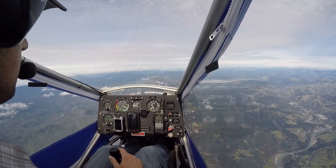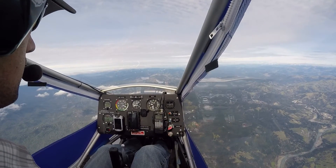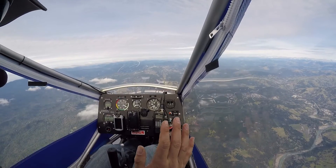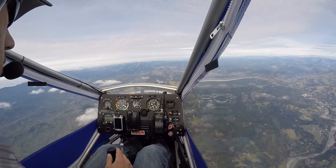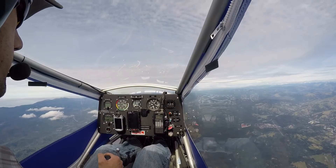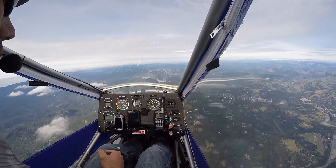All right, we just completed our clearing turn. We're at 7500 feet — 7000 feet above the lowest spot below us, in a safe area, so if anything goes wrong we're not going to hurt anybody, and we can still glide to the airport if I can't restart. The purpose of this test is to see how the plane behaves with the engine completely off and propeller stopped in a stall. The temp's coming down — shutting it down. All right, it's at idle — not touching anything, sitting right at 50. Off we go. Engine is completely off, we're gliding. Trim it for 50.